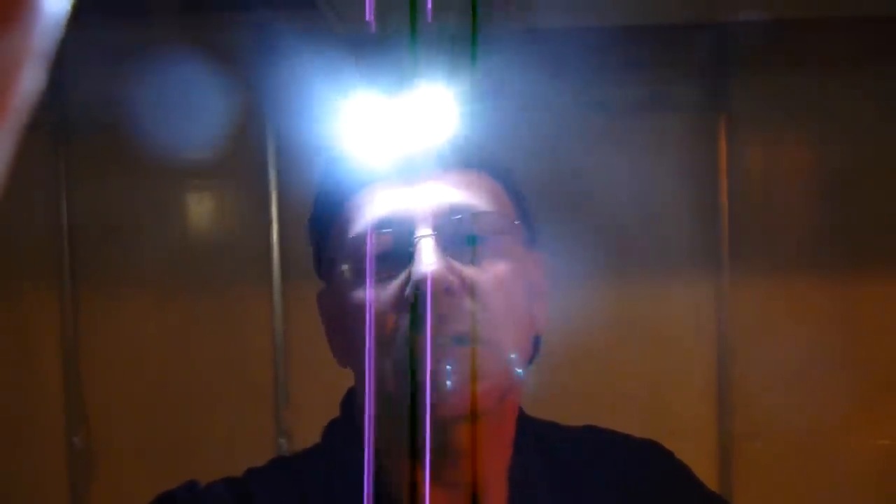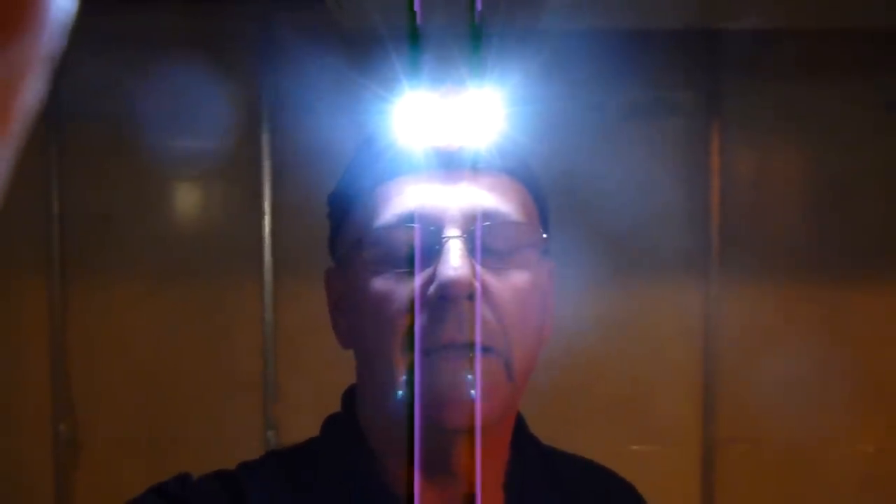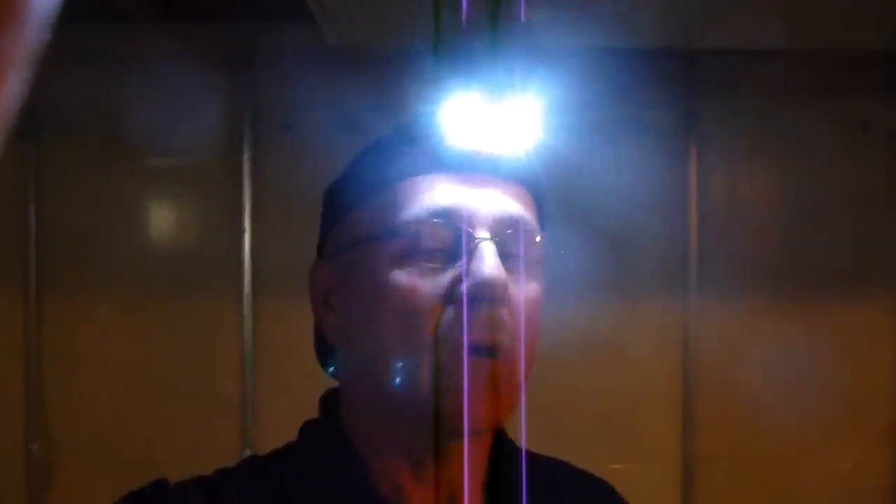These valves are one-way valves that will close if sewage returns towards the house if the system is backing up for whatever reason, and they should in theory protect the house from a sewer backup occurring in the home. A lot of people are not aware that these valves actually cease working unless you keep them clean, and that's why I wanted to show you this today, because this was a good example.